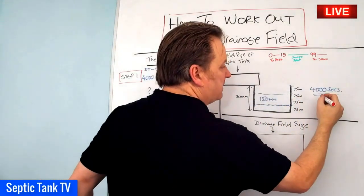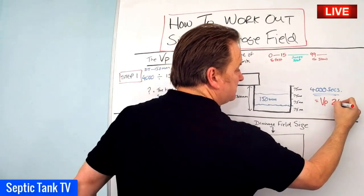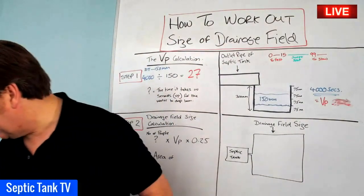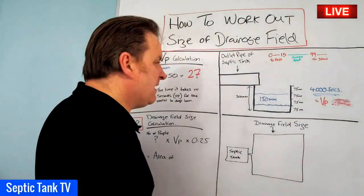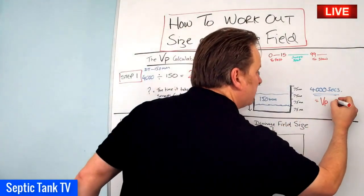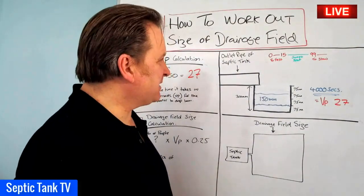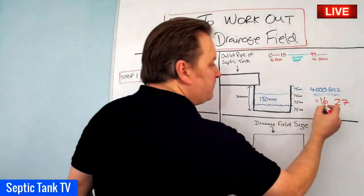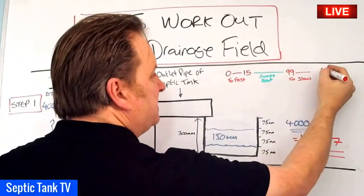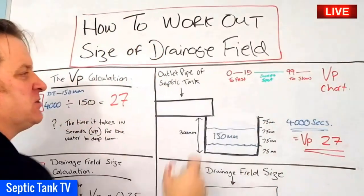So 4,000 seconds there equals a VP number of 26.6 seconds. So for argument's sake, let's round that 26.6 off to 27. Hopefully you're with me so far. Now that figure is very important because if you look here, this is a VP chart, a percolation chart.